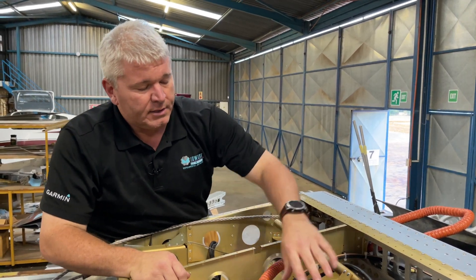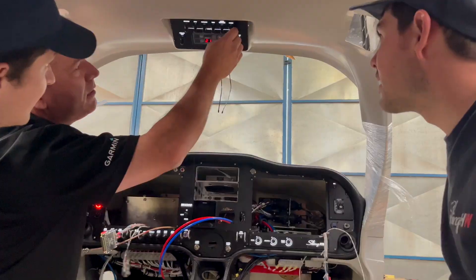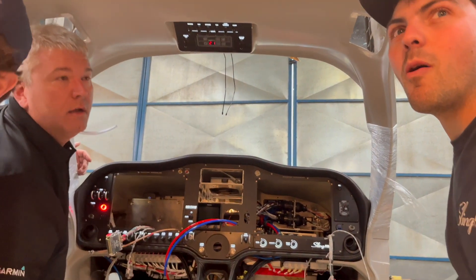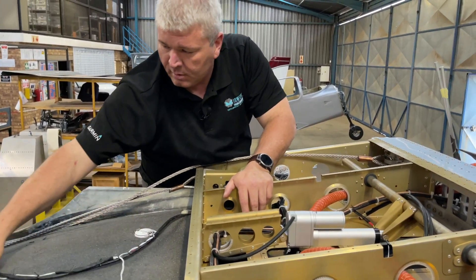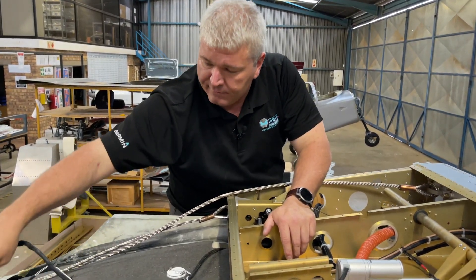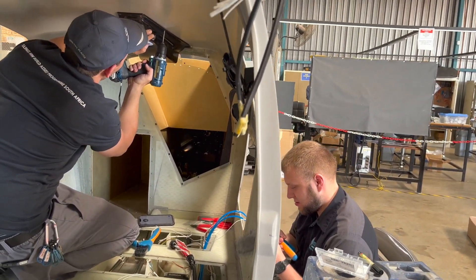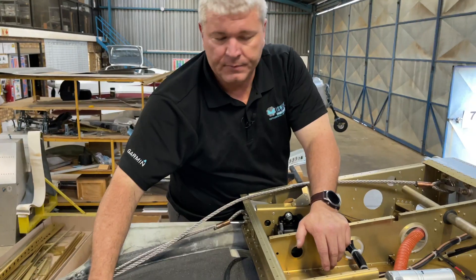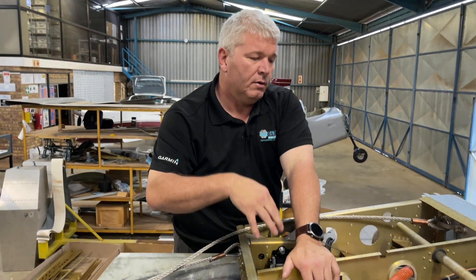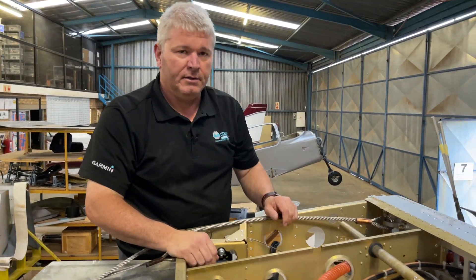You also have your wiring for your front cabin lights, and then rear cabin lights come through here. We actually have three — two for the passengers and one for the luggage area. And then our wires for our headphone jacks will go back here, which when we look inside you'll see where the plug-in is for those as well. Now we'll have Adam show you below how the routing goes from the top box down to where the panel is.